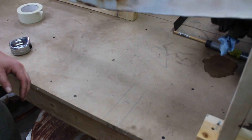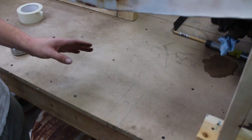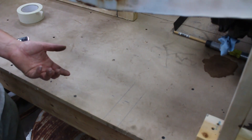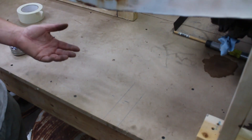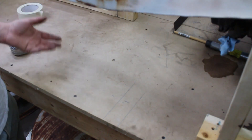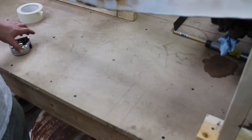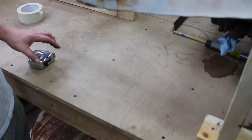I'm trying to locate the furthest back cross car chassis tube. It's going to be a two-inch piece. The NHRA cage specs require that you have two-inch tube. I believe it's .083 wall at the bottom plane of the chassis. So the first big tube is going to go here — it's 26 inches from the rear axle centerline to the back.